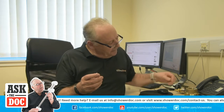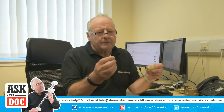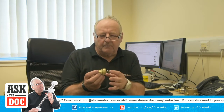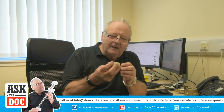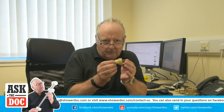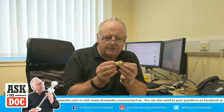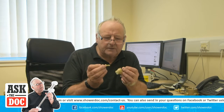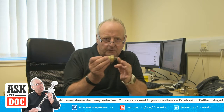In a bit more detail: this pin usually fits — in most showers — into something called the shuttle. It's called a shuttle because it shuttles back and forward between the hot and cold ports inside the shower. As the wax expands and contracts, this moves back and forward.